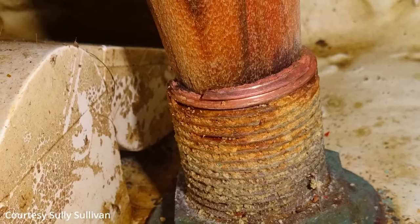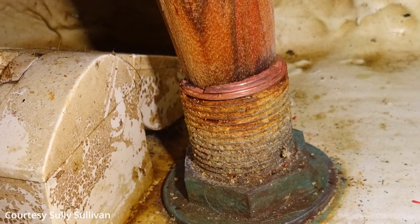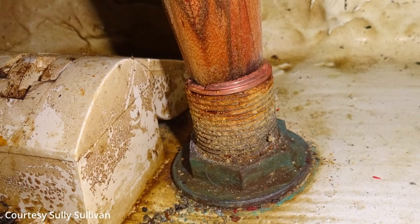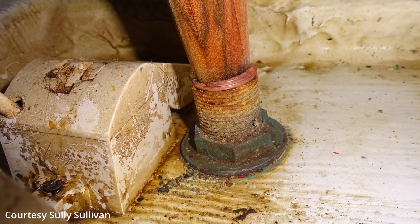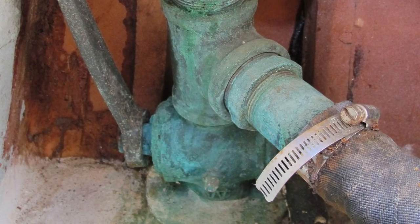They've sent me the pictures. They've had to plug the holes pretty quickly. There's a lot of water that comes in when you get a hole below the waterline. In the old days we always used bronze — silicon bronze typically for through-hulls — and it's pretty much impervious to corrosion. But any kind of brass is a problem.